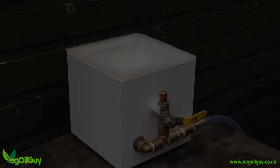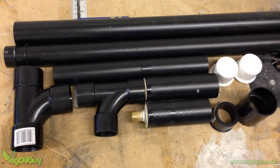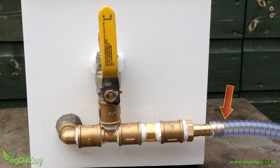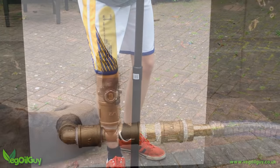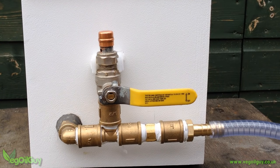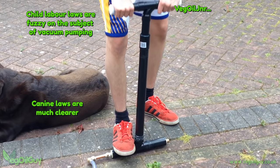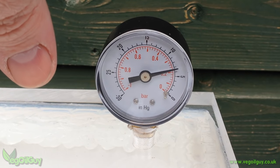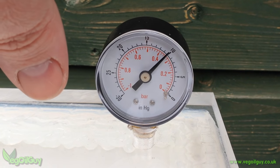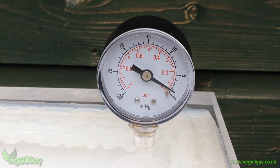But does it work? I made a pump based on the King of Random's design, modifying as necessary for UK parts and fittings. The pump gets connected to the vacuum chamber using flexible reinforced hose, and the handle of the pump gets pumped. But first, set the lever valve to the closed position. Initially it's necessary to apply just the slightest pressure to the lid of the box, just until the vacuum begins to grip — this is my son Michael doing the honours. We can see the pressure building steadily with each push of the handle, and the pressure can easily be released with the smallest turn of the lever valve. So it works — the vacuum chamber holds a vacuum.